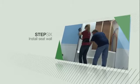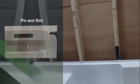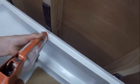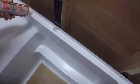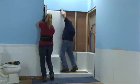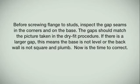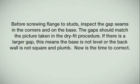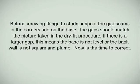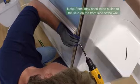Now it's time to install the wall opposite the valve. Your shower features a pin and slot system that enables you to install all panels from the front finish side without requiring rear access. Begin by using the 100% silicone adhesive, applying it to the base ledge as shown, encircling the single pin and any shipping bolt holes on the ledge. Lift the wall panel into place, guiding the wall over the alignment pin. Check alignment of the tile grout line, and before screwing the flange to studs, inspect the gap seams in the corners and on the base. The gaps should match the picture taken in the dry fit procedure — if there is a larger gap, this means the base is not level or the back wall is not square and plumb. Now is the time to correct this. Secure the wall to studs with screws, shimming where necessary to ensure wall surfaces are flush.